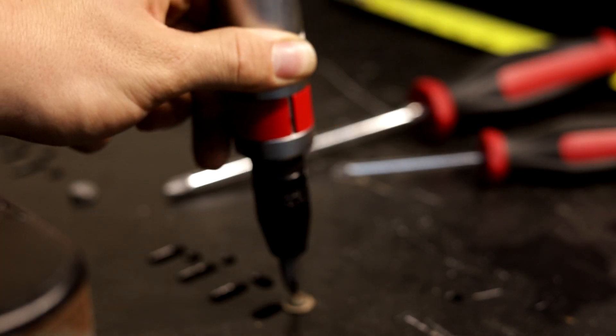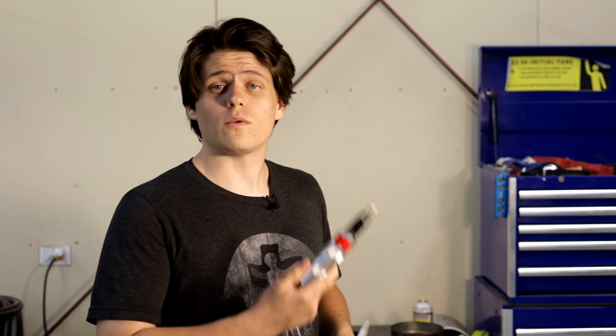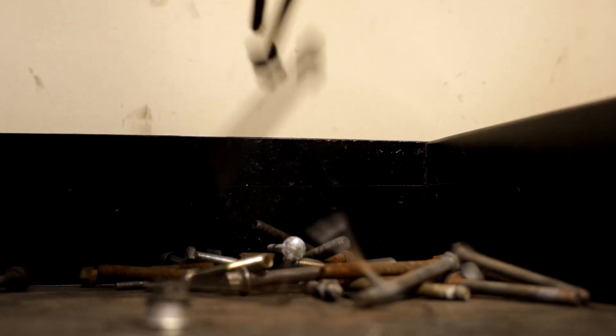This tool is specifically designed for very tight Phillips head screws and other drive types with the appropriate bit. They usually come with a flat head bit and multiple Phillips head size bits. When you apply force with a hammer it creates a downward force on the screw and also a turning force. It's very rare that it doesn't work — just make sure what's behind the screw is strong enough to take the impact. This is a very worthwhile tool to pick up; I'll leave a link in the description below.